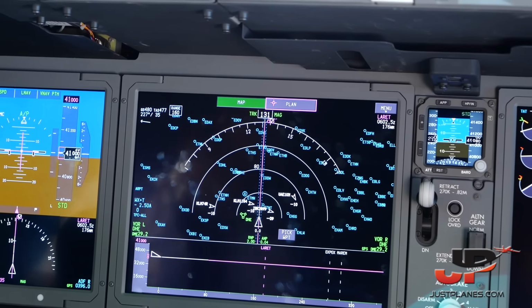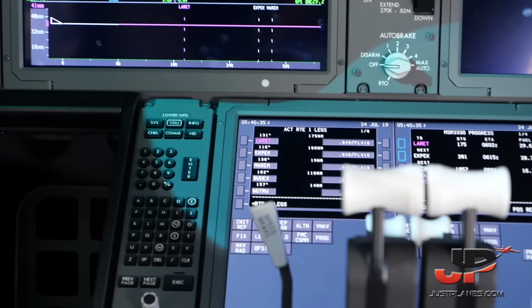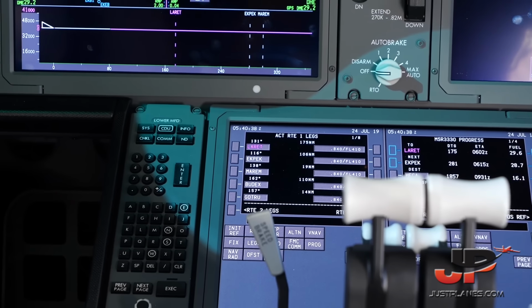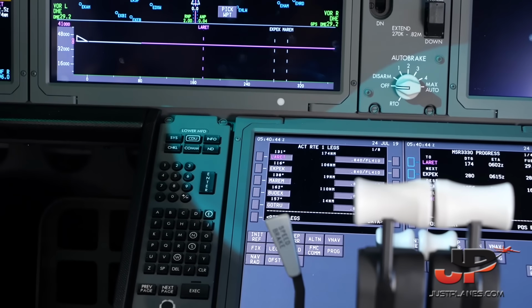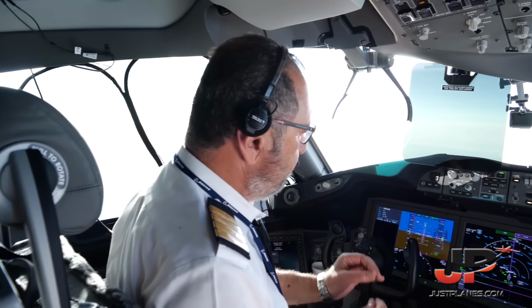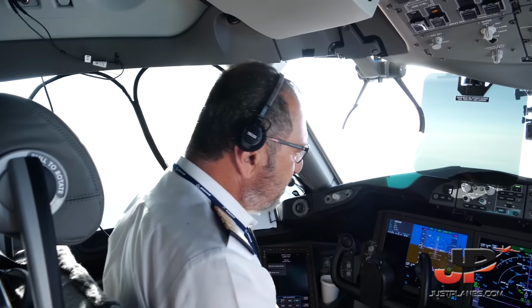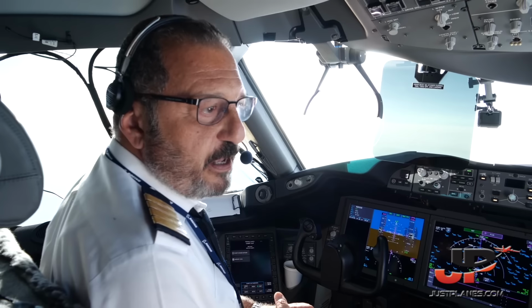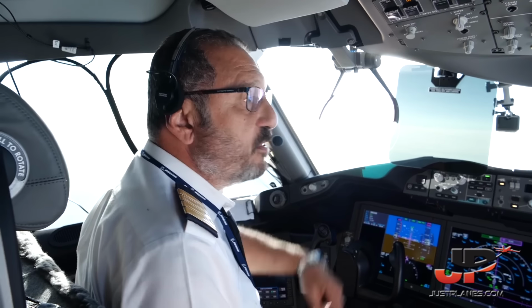Linz is very important. It's a brand new aircraft, so we had to check our RVSM, reduced vertical separation. They have equipment there in Linz which measures our altitude and reads our altimeter to check the tolerance we have, the deviation. It's maximum 50 feet. Imagine we're flying at 41,000 feet, which is almost 12 and a half kilometers above sea level, and the difference is 50 feet. You can divide by three, so you know how small the difference is over all this distance.